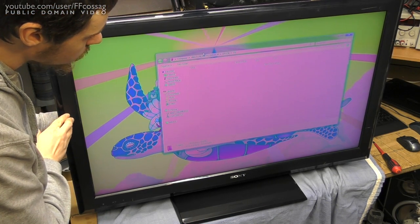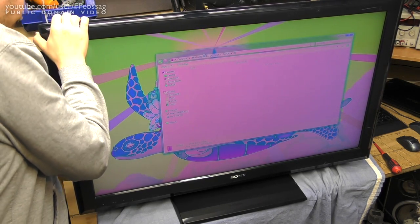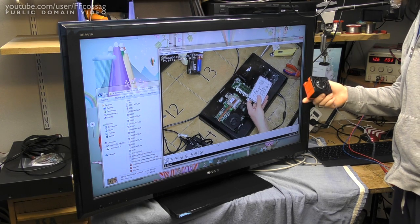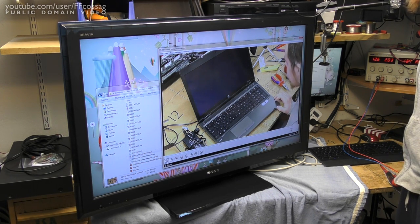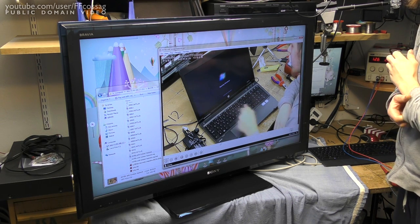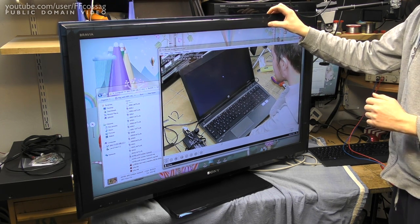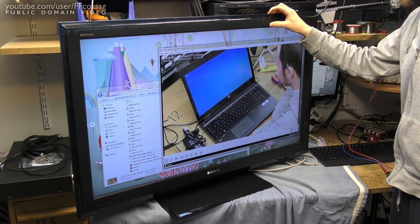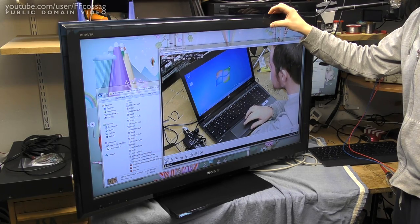Poking the BGA of the mainboard now - changes nothing. I've taken the time to cool all around the TV, cooling the mainboard, the Tcon board, everything. And I haven't been able to reproduce the issue to any extent whatsoever. As you can see right now, it's working perfectly fine. Which is a bit cryptic, because usually when you have these issues you can just heat around the board and get some results. But that really doesn't seem to apply to this TV. So what I'm going to do now is reconnect every single connector in the TV, because that can cause more issues than you would imagine.